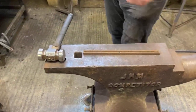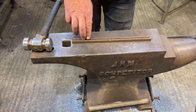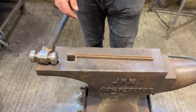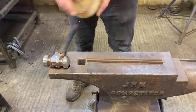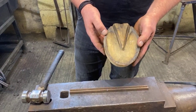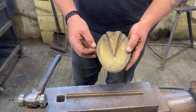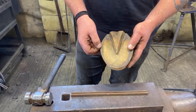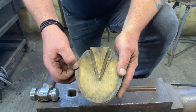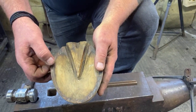Incidentally, where we're cutting under the foot, that means we're only going to be able to put a couple of nails really, really far back, extremely far back behind the quarter. So obviously we know the further back we nail, the more restriction we do to the function of the foot, and also the more likely we are to stab the horse. Okay, so the nails we do put in, and this is where you see a lot of apprentices get this wrong, is when they still stamp the nail hole in the center of the section. Well, you're going to go right through the sole.